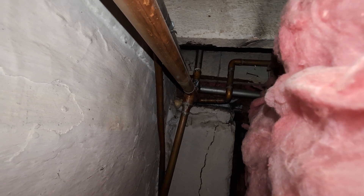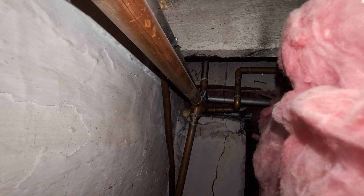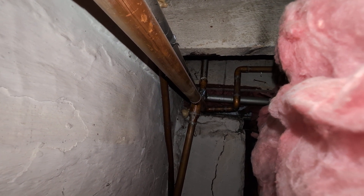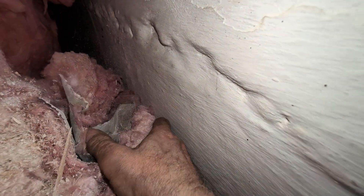There are only four radiators hooked up to this system now. The steam gets there, the radiators heat, and then the condensate comes rolling back and gets caught by the return. There's enough capacity, even with this boiler, to add one in maybe the middle bedroom or wherever. There's the drip going back — we reworked the wet return.